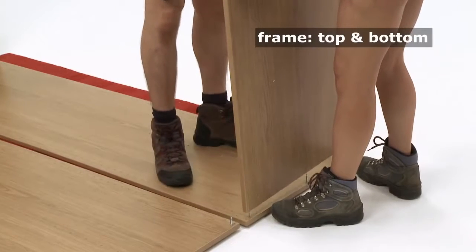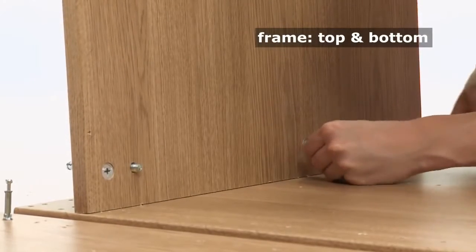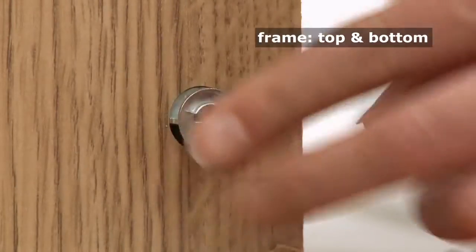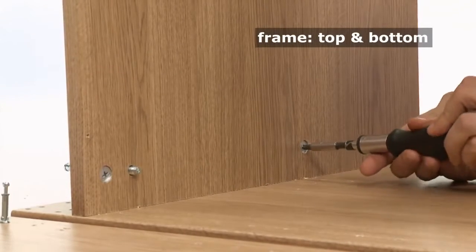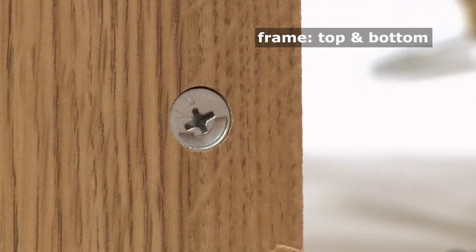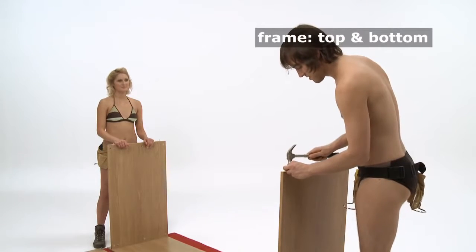And it's time to put the top panel onto the bolts at the top end. Fit the retaining nuts into their holes. They go this way up. They slip over the ends of the bolts, and then, when you turn them just half a turn or so, they tighten and create a nice tight connection. 3 at the top end, 3 at the bottom. There need to be 2 wooden pegs in the upward-facing edges of both the top and bottom panels.